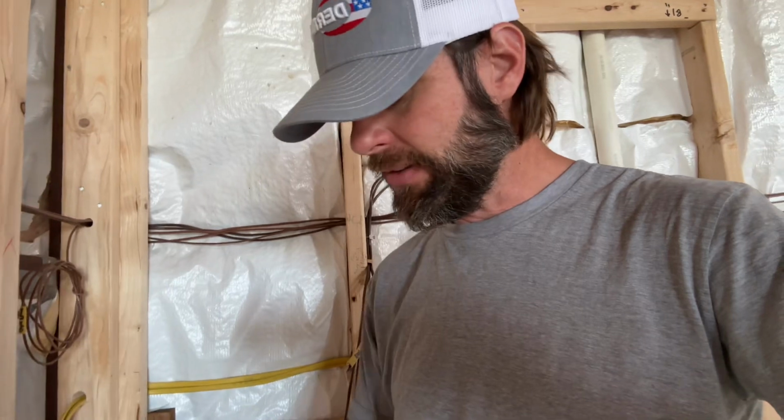I say that because I see time and time again people like, man, I really wish I had an air compressor over here, but I didn't wire for it. Or I wish I had a dog blower for my dog wash station that I'm putting in, but I didn't wire for it. So just think about the futures. Put more outlets than you need and put more circuits than you need. And what I mean by circuits is a home run.